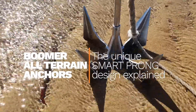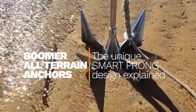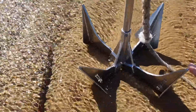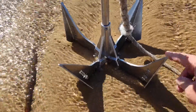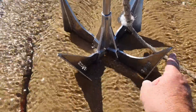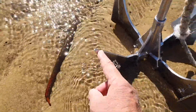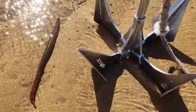I felt it was important to explain the reasons why we decided to put different types of prongs on the boomer anchor. We've got these prongs here, which are classed as what we call the penetration prongs — they have a shallower angle to penetrate. And these prongs here have a deeper angle on them, so I call those the outrigger prongs.